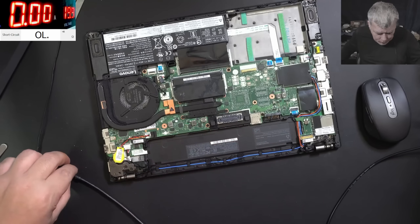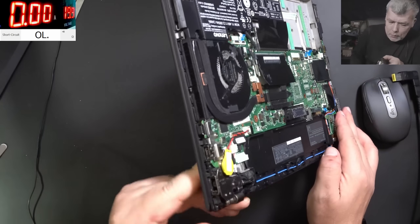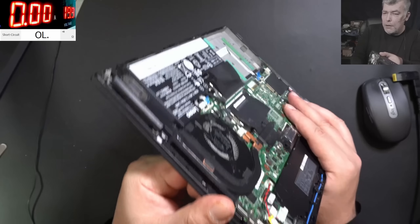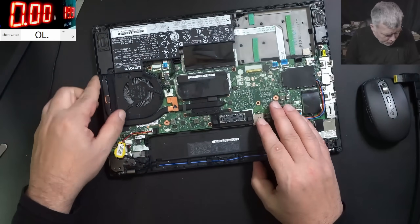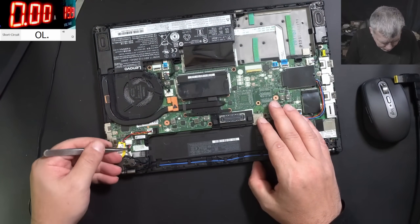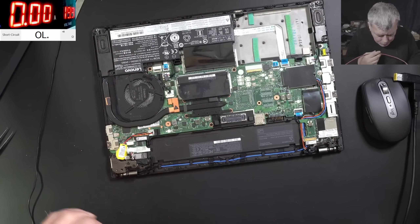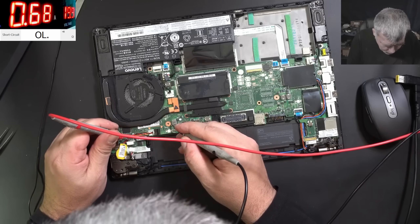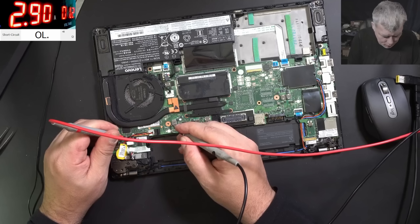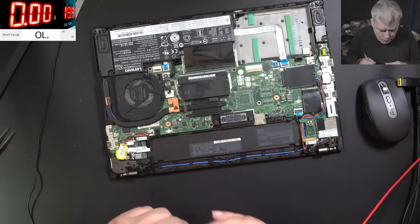Okay, this is kind of unique — at the charging port. Do you think it's a dodgy charging port? No, it's not even damaged. But let's try something else. Let's unplug the charger and the charging port, and plug the lab power supply — minus, plus. And it is shorted.